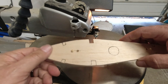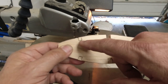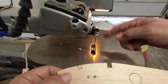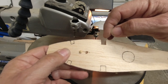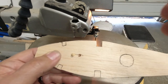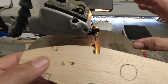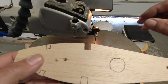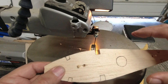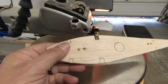Let's go ahead and cut out the bottom one here. I'll follow the same method — you use that same X pattern on all the quarter-inch ones as well, it's just a little smaller in size to work with. The nice thing about the blade as it's operating up and down is you can just kind of tap it on wood and it will slowly eat away pieces. It's not like a circular saw where everything has to be a straight line. There's a lot of dancing you can do with this blade — it just takes some finesse and skill that you learn over time. Just take your time with it.